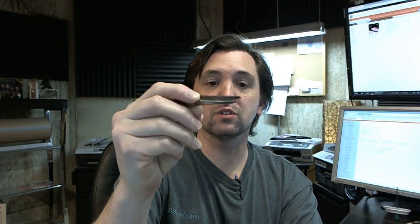A keying kit can range anywhere from less than $100 to a few hundred dollars. However, it doesn't stop at you needing just simply a keying kit. You need other tools as well, like a plug follower — here's the plug follower that I use and I've been using for a long time. Locksmithing tweezers are also very common items. Some people use tweezers, some don't. You will also need blank keys, so you'd have to be buying blank keys to cut your own keys generally.